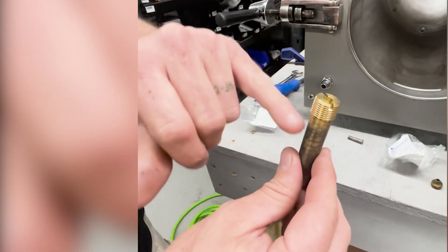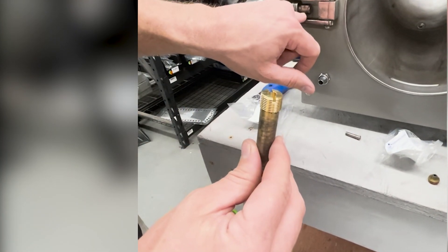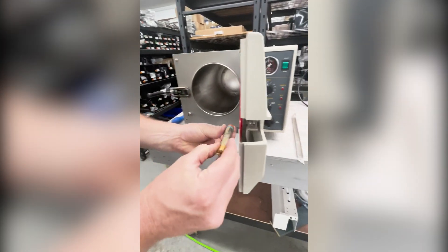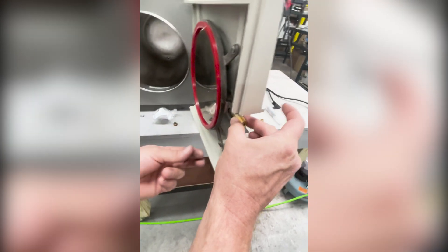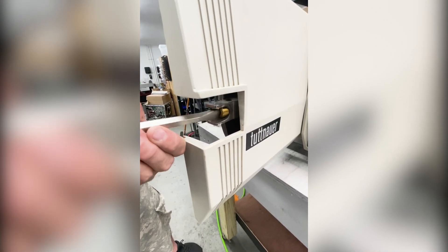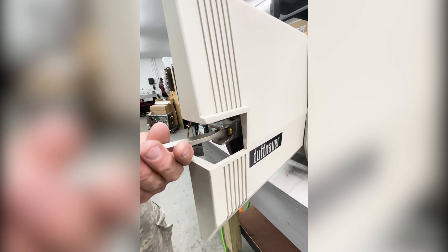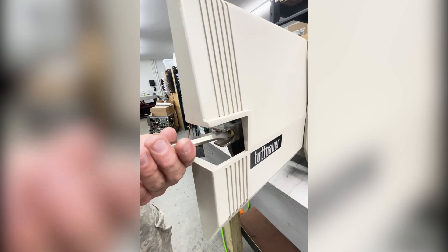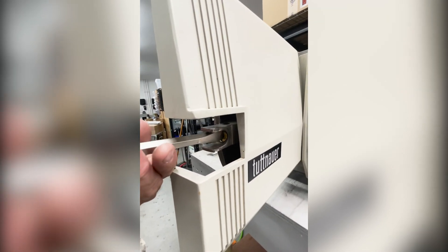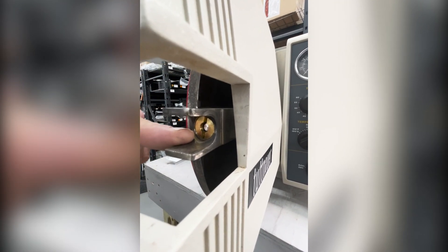It will sit like that and right here it'll sit flush. If you have this backwards, it will not set down far enough and you will eat away at the front of it — it will not shut right. So put this back in, hold it in place, slide it into place, and tighten it all the way down. Because those threads were cut, this is nice and smooth going in.